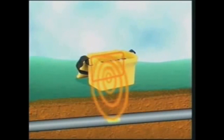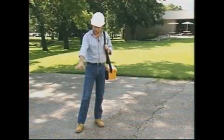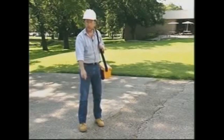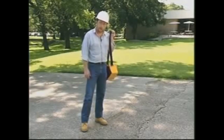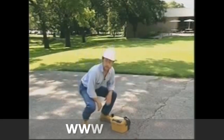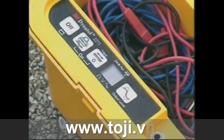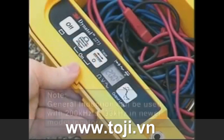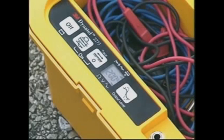When surface access to a buried conductor is not available, you can still apply a signal to the conductor using the induction method. The transmitter signal comes from an internal antenna and couples onto the buried conductor. It's obvious something is buried here because the pavement has been repaired. Since there's no easy access to apply the signal, I'll have to use the induction method. To apply a signal, put the transmitter on the ground over the buried conductor and line up the lid hinge with the conductor path. Press the trace key to turn the unit on and select the 200 kilohertz frequency. You can also use high power by pressing the output level key when the received signal is weak. Be aware that the induction method applies a signal to every conductor in the immediate area near the transmitter.